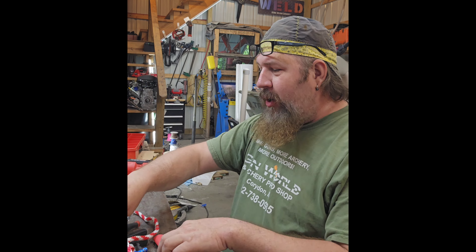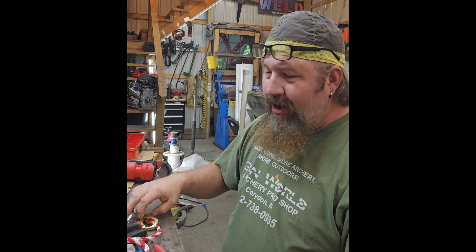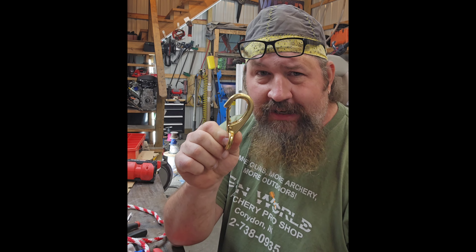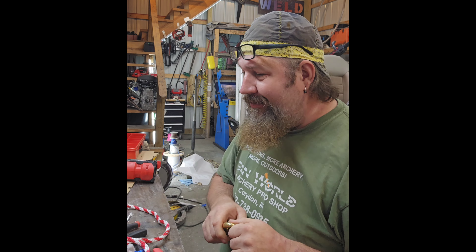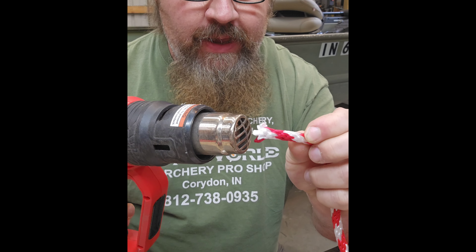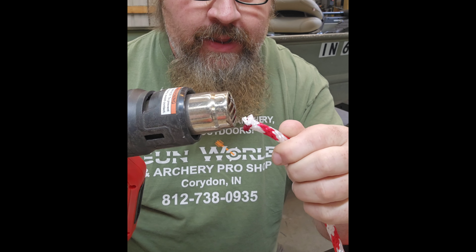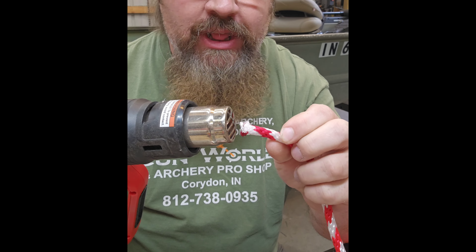In today's video we're gonna make a tie-off for a boat. I've got some three-eighths rope, some three-quarter inch heat shrink, and a large brass clasp — big enough to go on the bow eye of this Jon boat. I'm gonna start with my heat gun, take my three-eighths rope, fluff the end up a little bit, and then just hit it with a heat gun. You can do this with a torch — open flame is fine. Get it to where it's all nice and gooey looking.